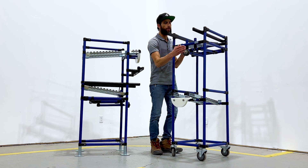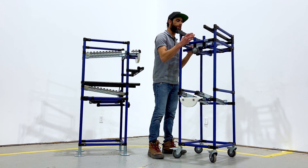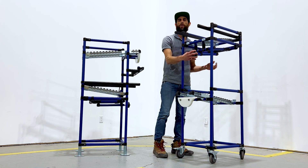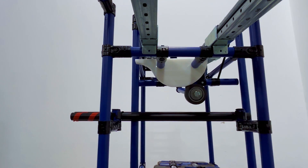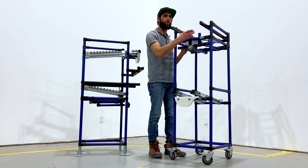We have a wheel that is going to follow the path of the HDPE cutouts that we have made in order to drop down that mechanism, which is being held by HJ12s and the AP aluminum hinge. From there, that mechanism will be pulled back up by the bungee cord that we have attached. And we have two pipes acting as our stopper.